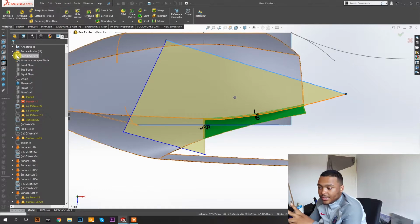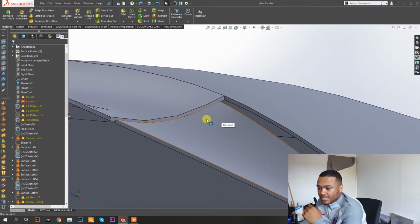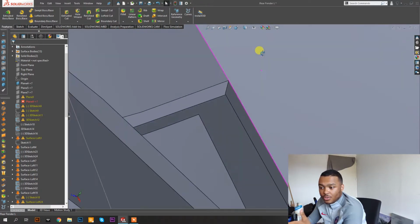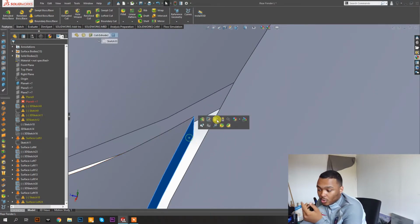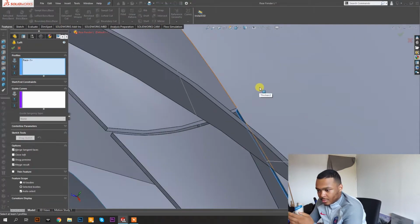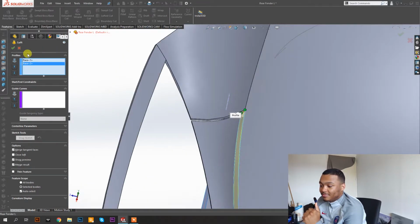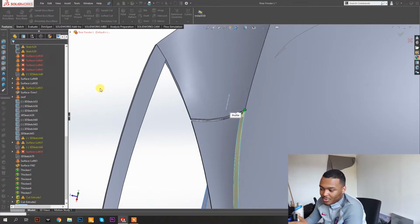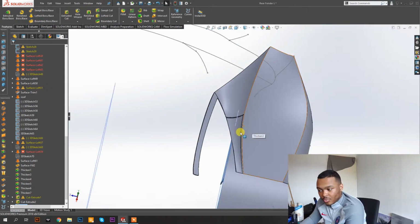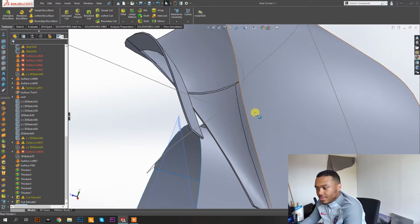There are two things that you can do from this point going forward, and one of them is the easiest one, and it is just to use the loft tool to select this surface, and they will connect. Sometimes you're very lucky and that will work, but for the video purposes it would be great if it doesn't work right now, but we'll see what happens. So if I select OK, and it works. That is kind of disappointing from the video point of view, but sometimes it will say that these bodies can't really connect with each other because there are two separate entities, and the loft being created in between would create another zero thickness geometry, things of that nature.